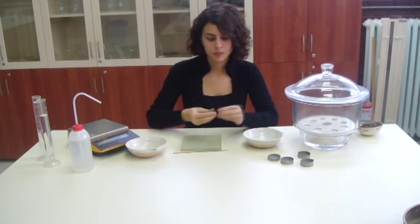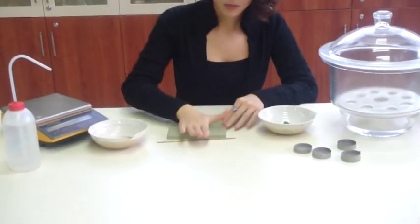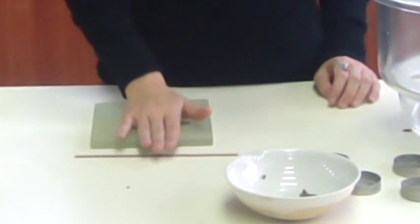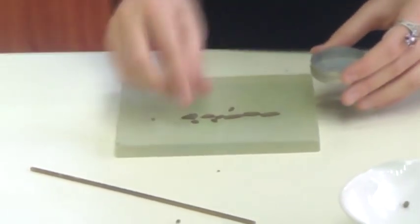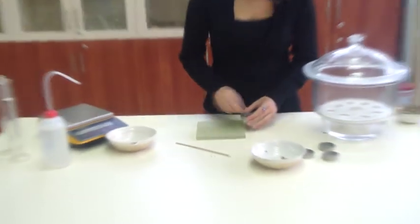Take a piece from the sample. By using the first finger and thumb of each hand, roll the soil to a diameter of 3 mm. Use the bar to verify that the soil is now 3 mm in diameter. Place the crumbled soil thread into a suitable container and determine the moisture content. The water content when the soil cracks gives the plastic limit of the sample.